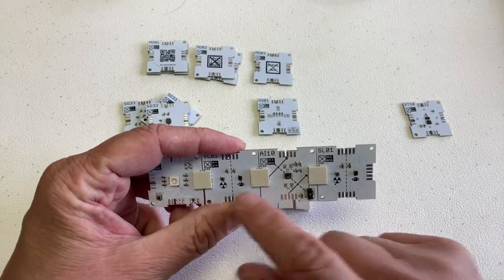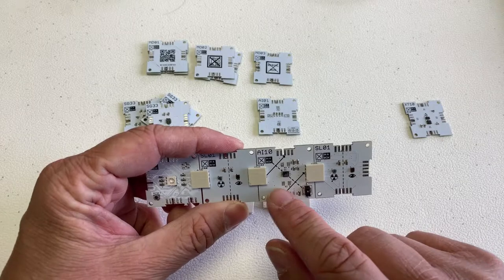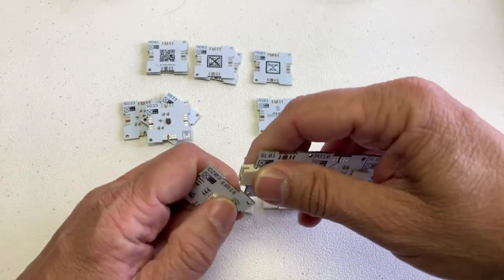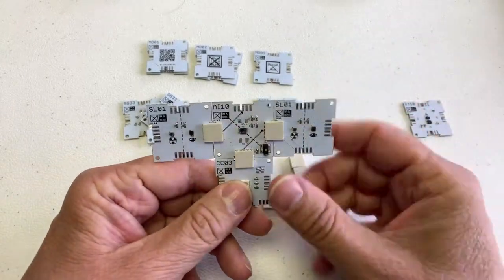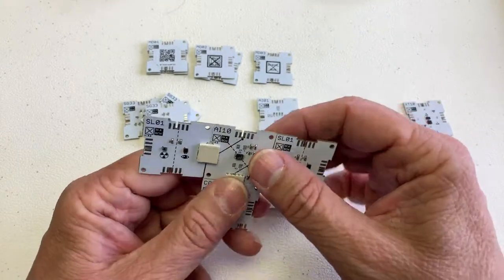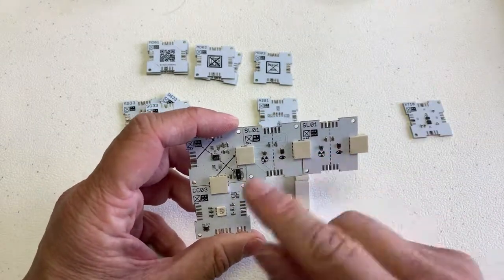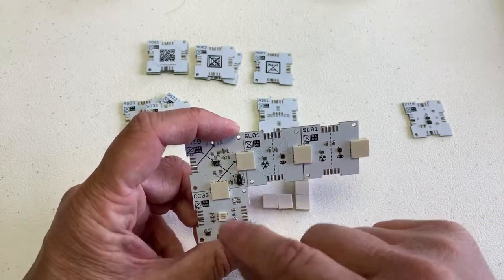So I have my core here. On this side I'm talking to it the normal way, and here I change the address. So when it responds, the core will see this as 4F. I can also put my circuits together like this, because this is the same circuit on this side here. If I take the SL01 and put it next to it over here, it will not work — these will respond to the same address, both 4F, because they're both after the address selection.